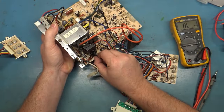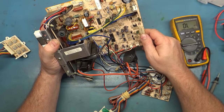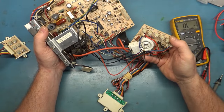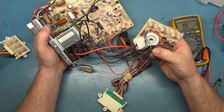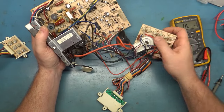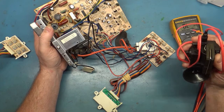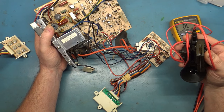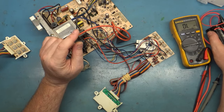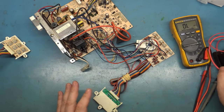The flyback is 100% all the way down and we still had the blue screen with the retrace line — so something is being way over-driven. It's either going to be the flyback or something on the neckboard. We could swap the neckboards — you just have to desolder the focus pin and the G2 pin and swap it out. He wants me to put this flyback back in anyway, so let me get that done, try it out, and if it doesn't work I'll come back and swap out neckboards.